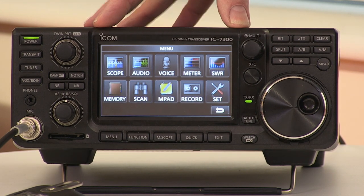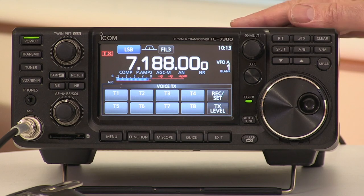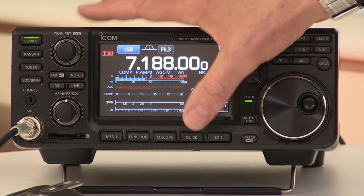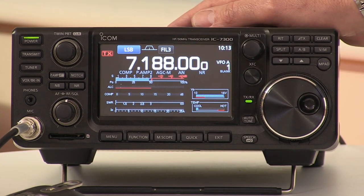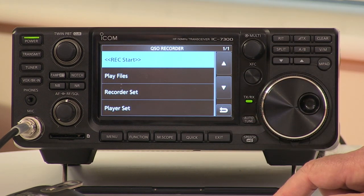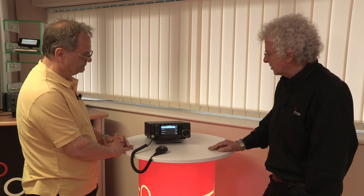From the front panel you've got a feature menu with a voice recorder where you can record CQs. You've got a meter display giving you all the necessary transmit and receive functions — ALC, SWR, temperature, and even supply voltage. The voice recorder records onto the SD card, which is great for contesting — it'll call CQ for you until somebody comes back. You can also record incoming audio or the whole QSO including your own audio, and export it as a standard WAV file via the SD card or USB lead on the back.